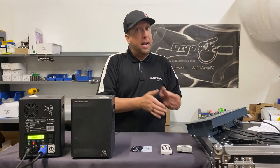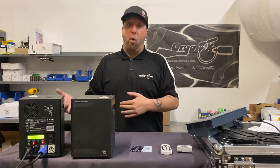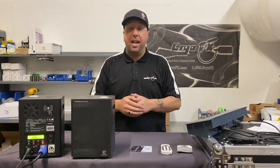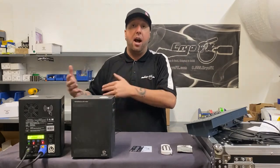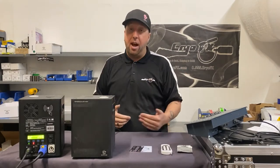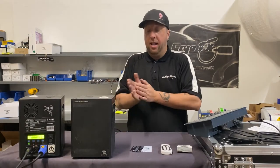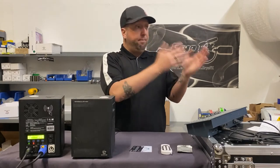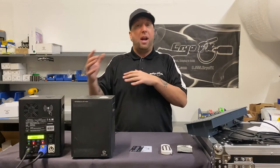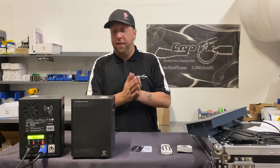If you add two more machines that's about the max for a 20-amp breaker. Most power strips have 15-amp breakers, so plugging four machines into one will pop the breaker - it may not pop immediately but it will. The most power is drawn when the heating element starts heating up, so that's when wires inside your cords heat up and trip the breaker. The breaker is designed to do that. On the back of the machine it lists the wattage - 480 watts for the Sparkular Mini - so you can do your calculations.